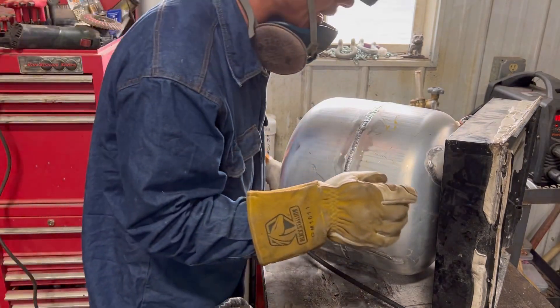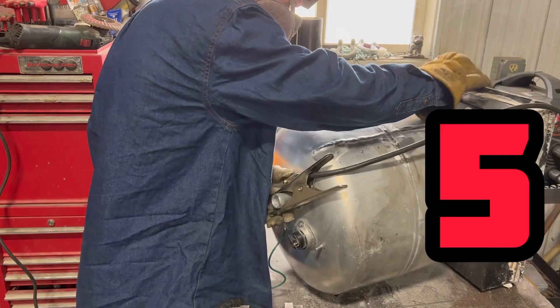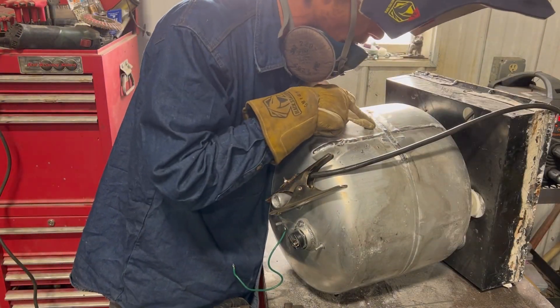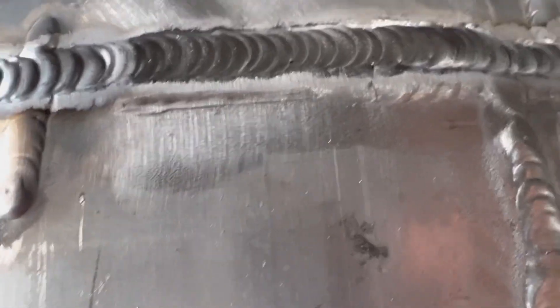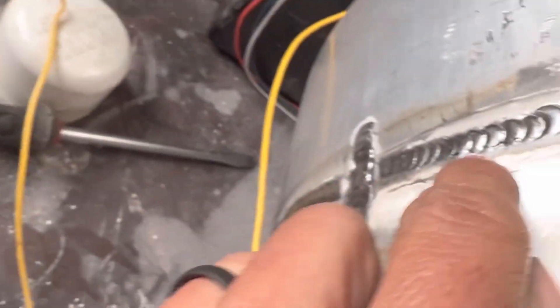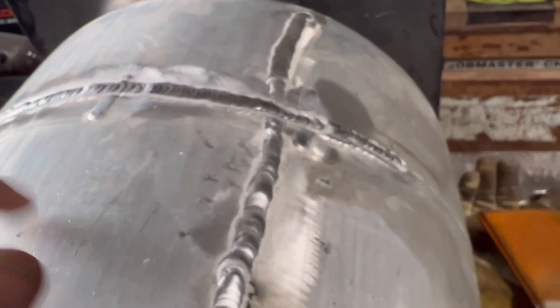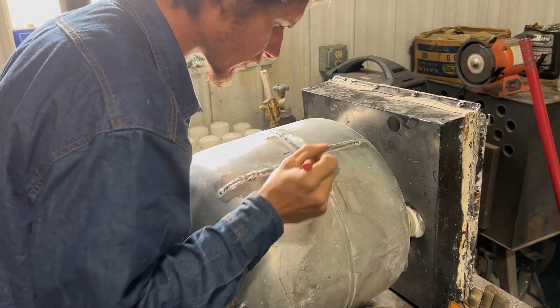It's looking pretty freaking good, but while we were welding, a couple other cracks revealed themselves. So I'm going to keep tracing cracks on this thing — got two more cracks. Got a pretty solid weld, but as you can see, something I didn't notice before: that crack showed its head when I started welding, and that crack showed its head when I was welding. So we'll grind those out and fix those as well. I may actually run another pass — this all looks pretty good right here. We have a little spot where something happened, a little dimple. This is a good deep penetrating weld — probably thicker than the material itself. I've got my Sharpie here and I'm going to identify the cracks and give it a once-over.